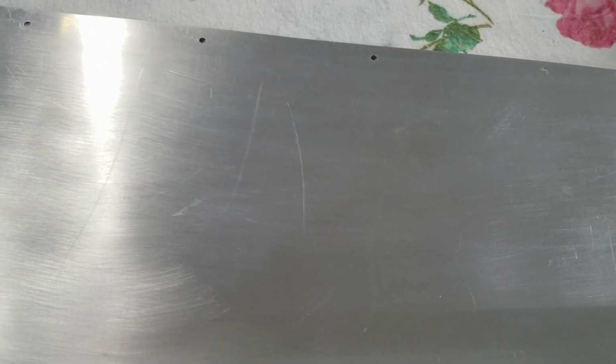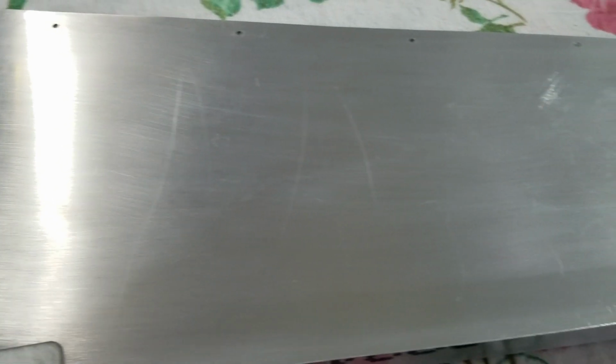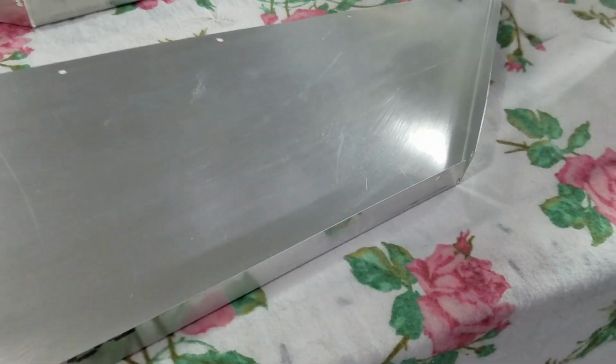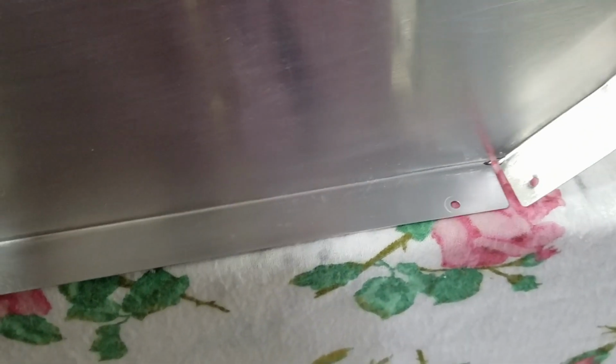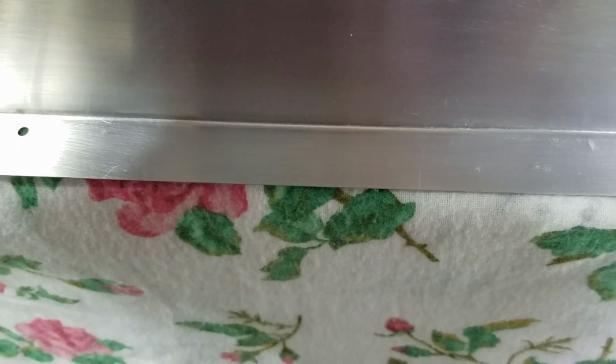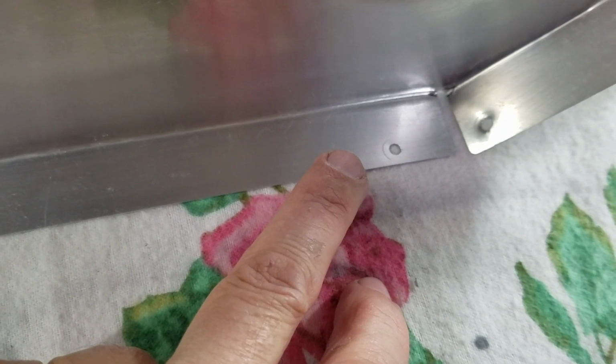So we're getting ready to wet these down with glue, and we've got from 5 to 15 minutes, I think it says, to put it on. So we'll see how that goes. I'm really planning on, I'm going to tape these. To make a corner like this, for someone like me that don't know what they're doing, I noticed yesterday on the glare shield you can get in a lot of trouble on a corner because if it touches it sticks. So I think what I'm going to do is spray the flat part here, and tape this off, the leads down here where it bolts down. I'm going to tape it off and keep the glue off of it so it won't stick. There'll be nothing for it to stick to.